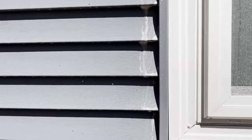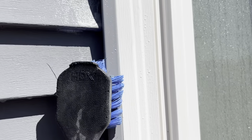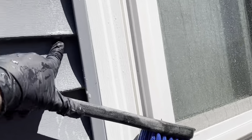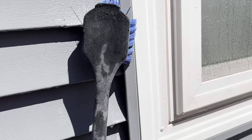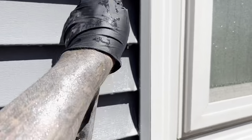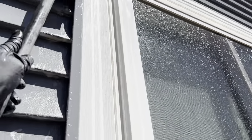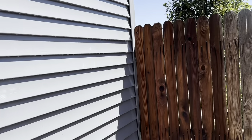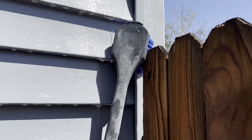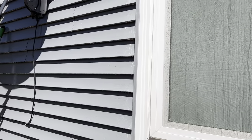One thing I'll show you that I've found really tricky to clean is these little inside areas here. I use this little brush, and I want to get those bristles kind of pushed behind. Other than that, with just my normal brushes I just can't get in these little grooves. Just got to get in there the best you can — it's not going to get perfect. I always let the customer know there are going to be little areas that are really impossible to get to. But on the bigger picture, having the entire siding cleaned and brushed down is far more important. So I'm going to do the same thing over here on these edges — all you're really doing is agitating the surface.